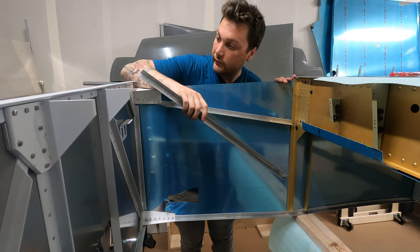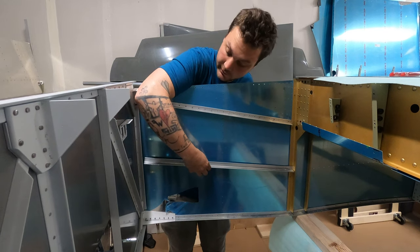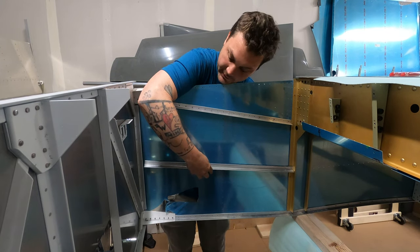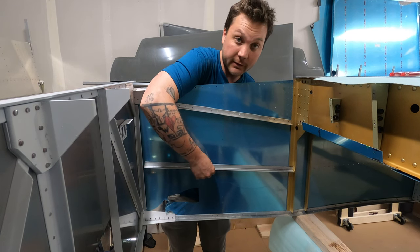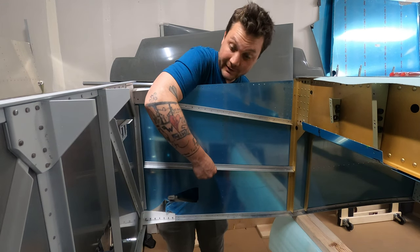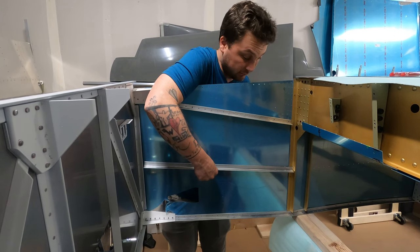These details are absolutely exhausting, but I think I got them fitting right. This piece is going to get clamped into position, much like the one above it, centered on these holes, and we'll get it clecoed there. Then I got to figure out the bracket on the forward end and how to get it drilled into position with limited access.